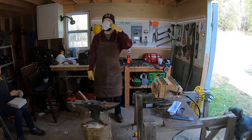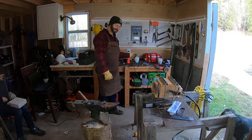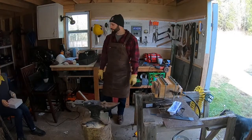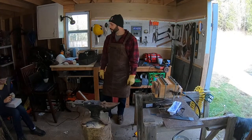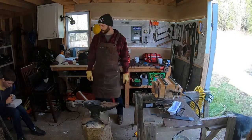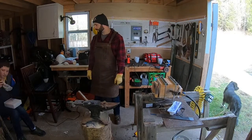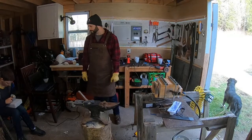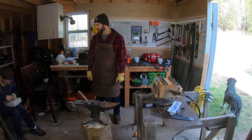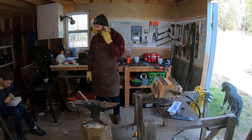A stop cut is where you cut a little notch into the wood and then you cut on a diagonal to kind of carve out a triangle out of your wood, but have it on a flat surface. So you cut straight down. Done. And then you go and you meet that cut. Stop cut. Very nice. And then you make it deeper by doing it again. The process, over and over and over again. Is that how they make those little train whistles? I have no idea. It's kind of like what it looks like.